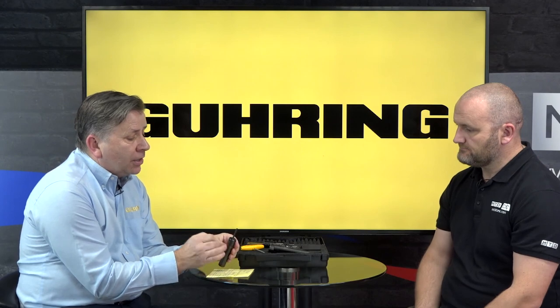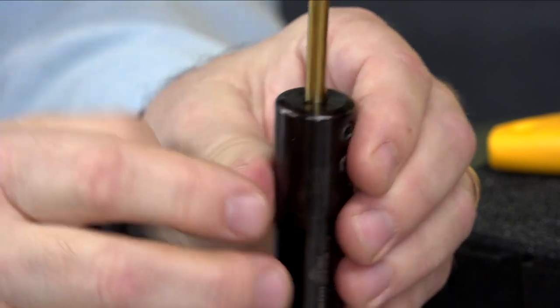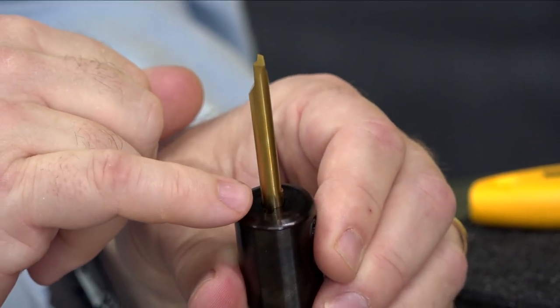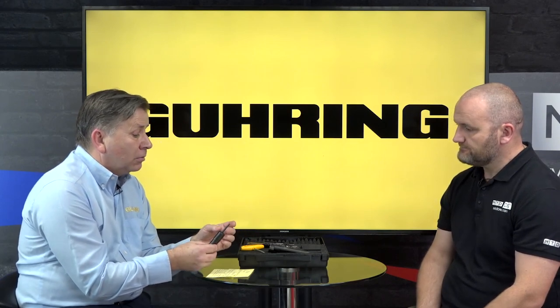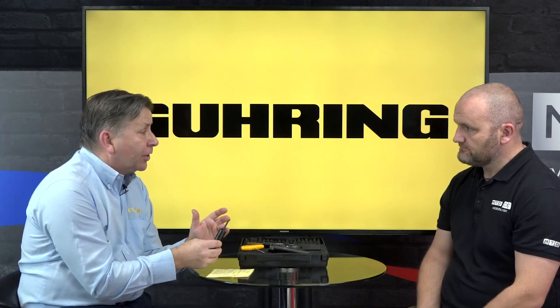The other key thing you can see on the end is the through coolant holes. We introduce through coolant through some large holes, so you get lots of volume and lots of pressure, like a curtain of coolant down the side. The benefit to the customer is swarf control and tool life. This is something that our competitors haven't done, really.